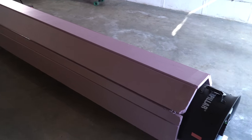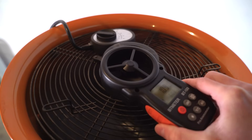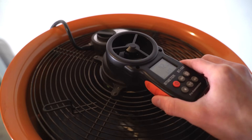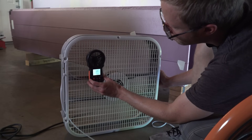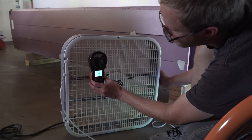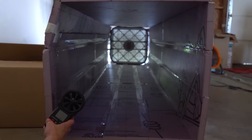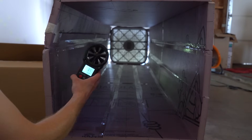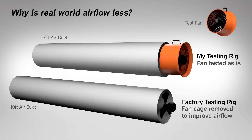To find out a fan's real-world performance, I built this wind tunnel. Measuring air velocity at the cage of a fan can give you a wide range of results that are difficult to convert into meaningful data. For instance, the air in the center of a fan has a velocity of zero and the edges have a high velocity, with a gradient in between. What we really want is the average of these numbers — a good way to find an average is to let the air mix in a wind tunnel and achieve a more consistent speed. As I understand it, when fans are tested at the manufacturer, they are put up on a test stand something like this, and the fan motor and blades may be tested on their own without the fan enclosures that can reduce air flow.